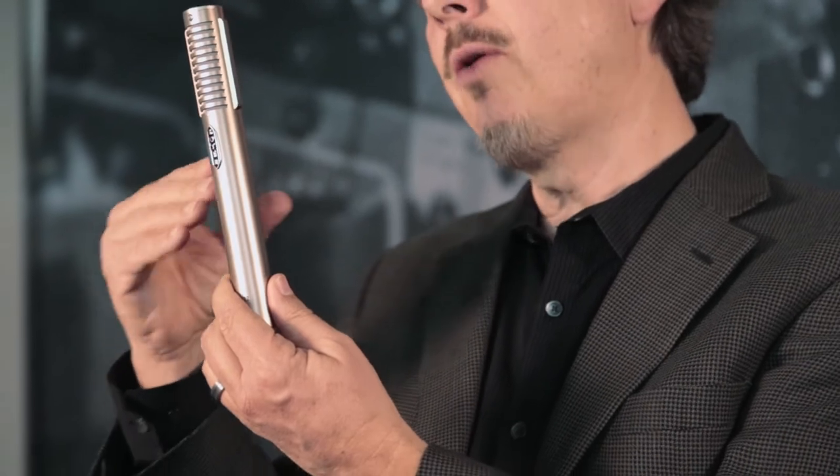There are a couple of switches on the back. The switch on top is a 15dB pad, and the pad comes before the microphone's electronics. So let's say you're recording some really heavy electric guitar and you've got this thing close on the cabinet — you've got too much level for your mic pre, or sometimes in the case of the 122, if you hit it really hard and you don't have a full 48 phantom power volts at the microphone, you can run it out of headroom.